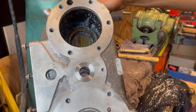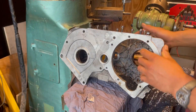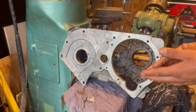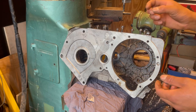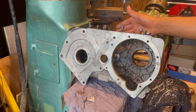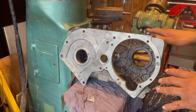I have a flange on the outside as well. Basically, all that's going to do is stop that sleeve pulling through this way and stop it coming back in. So that sleeve is actually split in two. Seeing as I had to split it in two, I decided to leave a small gap and put a little O-ring in there as well — so anything that helps reduce the oil loss is a bonus, because I don't want to get caught out like this ever again.